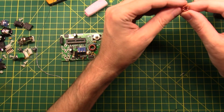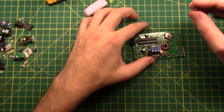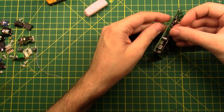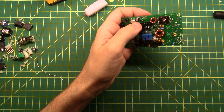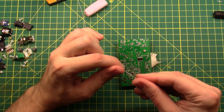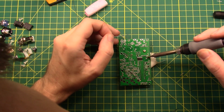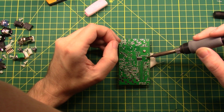Done and done. You just want to try and get these evenly spaced, and then it goes on to L4. We put the inside lead through the inside hole and the outside lead through the outside hole. I'm going to tape that down again like we did last time to make sure it's nice and flat. You should dwell on this with your soldering iron for at least 10 seconds — count it out in your head because it's going to feel like an eternity. You'll almost be able to see the change when the enamel has melted off. There it goes.